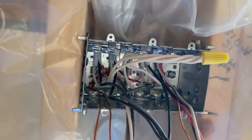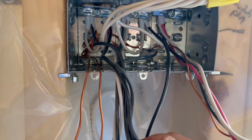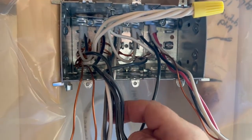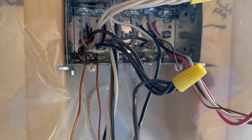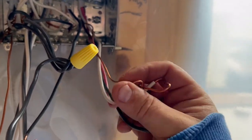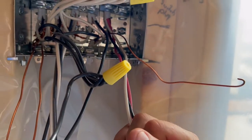For your blacks — here's your black power feed — we have some feeds in and some feeds out. This is power coming in from the panel going back out to some plugs or other lights. On the bottom we have tails; these tails come off and go to the switches — one side of the switch — and then the other side goes to the top of the switch. This here is a three-way, so we have the black common and the white and red travelers. This is what we call a three-way tail at the end of the line.